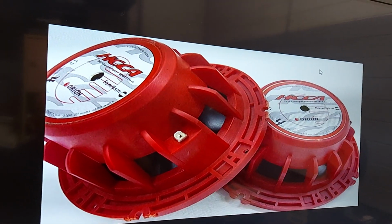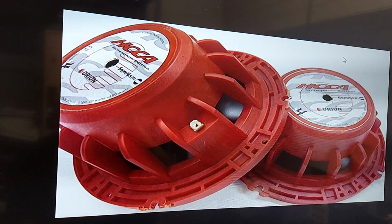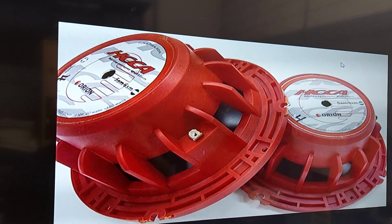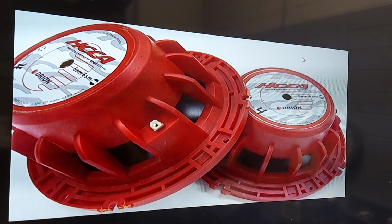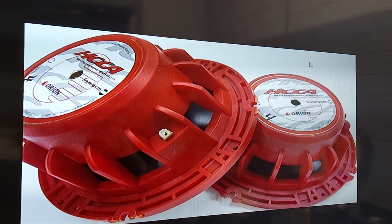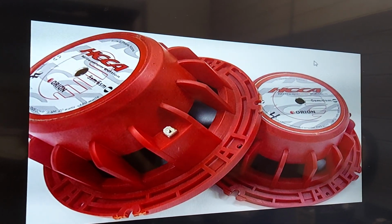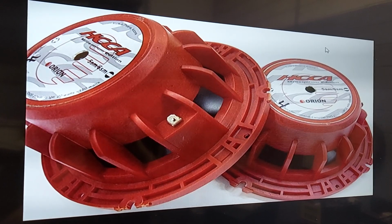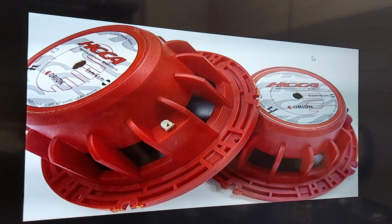But this was the pop top, and the idea was to include a chromed out version of that, either the 150R, which is the one after the pop top. I think, can't remember now. I think it was called the 425, and then it changed to the 150R. But anyways, the idea for the HCCAs was that you get something like the DVX2 crossover module that was for the pop tops, which is a 24 dB slope, or it can be a 24 dB slope filter if both filters are cascaded, meaning they're both at the same frequency and they're both applied. What it really is 2 12 dB filters, and you can either create a bandpass filter, or you can go up or down, or you can just enable one. And that was all in the pop top series with the jumpers and all that kind of stuff.